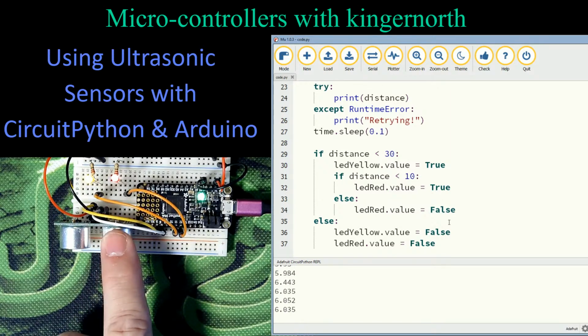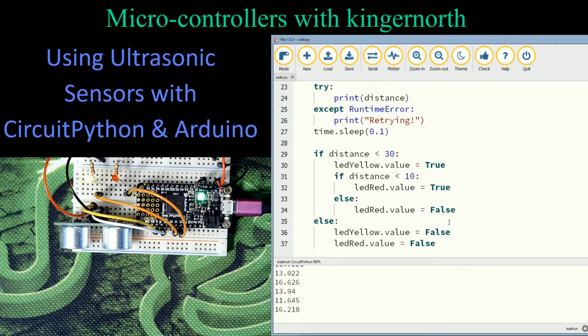This wouldn't be right on the edge of the unit. This would be set back behind usually a black piece of translucent glass. You don't even notice it. And what it says there, hey, I know that exactly 5 centimeters away from the sensor is the edge of the robot. That's where my sweeping arm reaches. So when I get to 5 centimeters, stop traveling in that direction so I don't slam against the wall. And then it can travel and it continues on down.